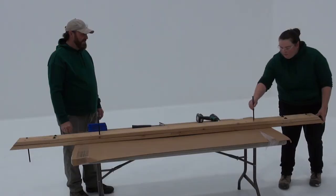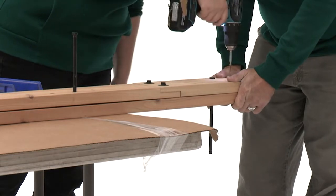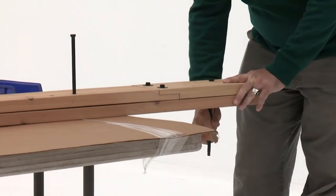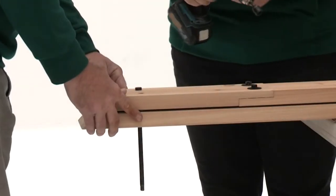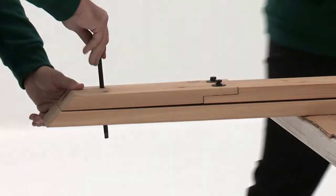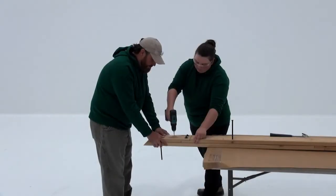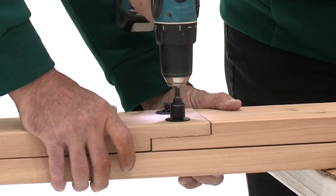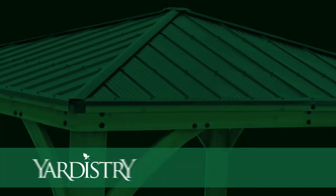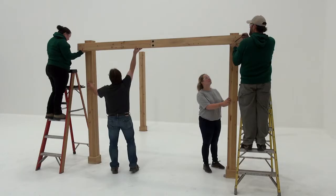Push long bolts through these four holes and temporarily secure the boards with wood screws at each end, then in the middle. If the second mitered end isn't flush, loosen the bolts in the beam end, then adjust the boards using a long bolt if necessary. Get a helper to hold the boards in place, then secure with wood screws. Now retighten the bolts in the beam end. Repeat each of these steps to make three more beam assemblies.